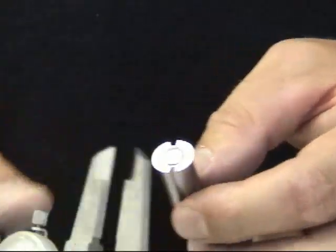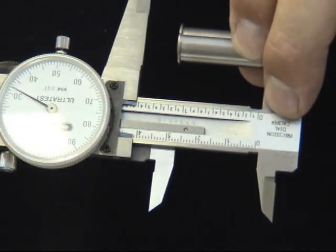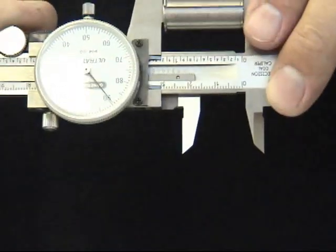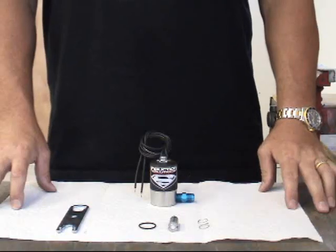On a self-compensating plunger, where it has the raised ring around the outside, we like to measure from the flat and we measure across the raised area for our dimension. Having the diameter of the stem and the overall length of the plunger is just another essential part in making sure we get you the right part the first time, 100%.